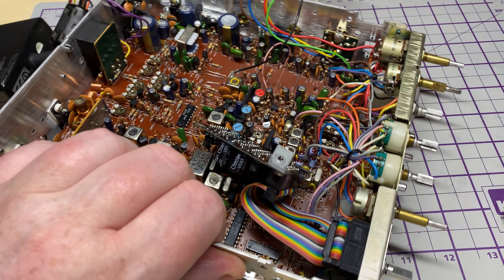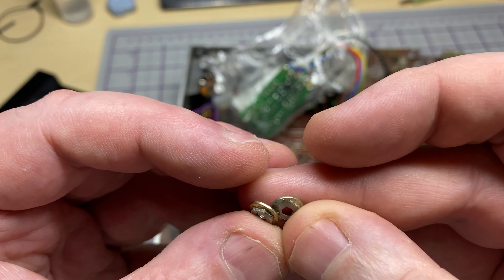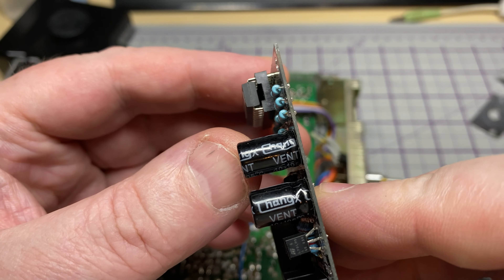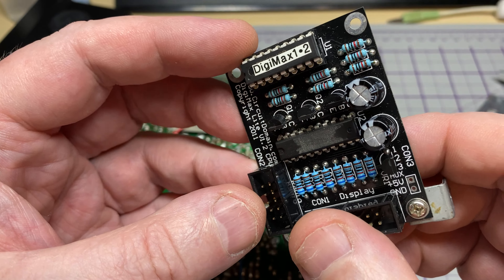Well, this is coming out anyway — that's what I think of that. These filed-down nuts are interesting — they hold the rotary encoder in place. Somebody's siliconed the RX/TX LED in, and we've got quality Cheng-X capacitors on the board, no expense spared. Underneath the ribbon that goes to the PLL we have some cut tracks — looks like somebody's been going at it with an axe.